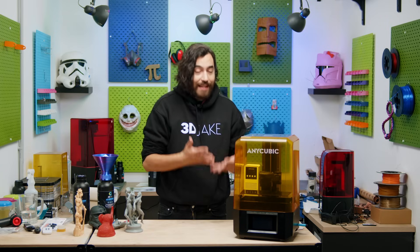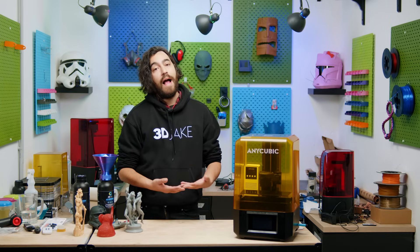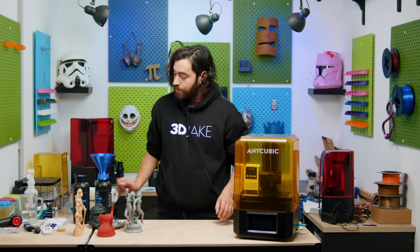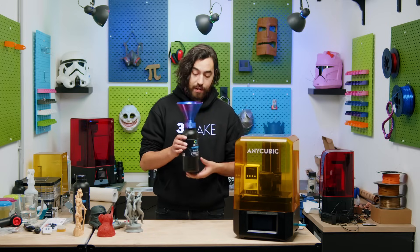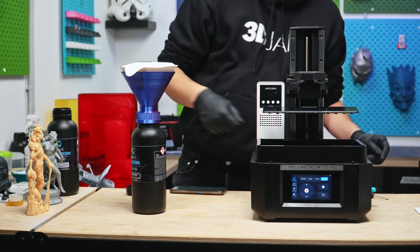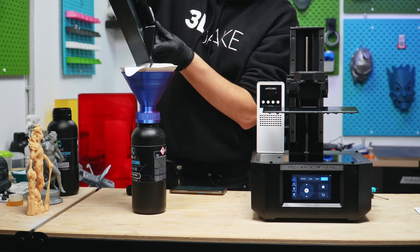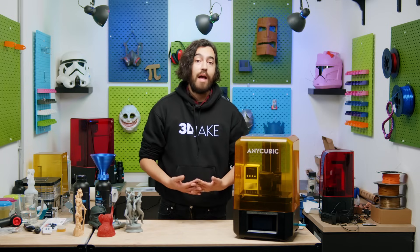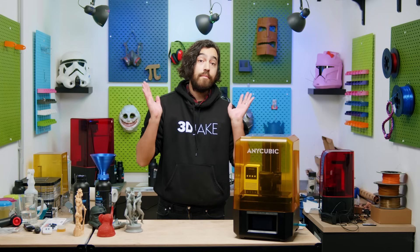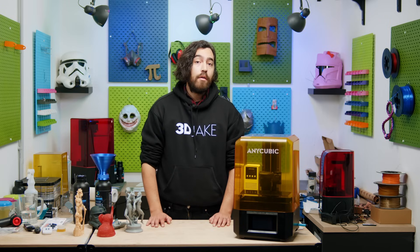But what other reasons do I have for liking this printer? The cleanup. Nobody likes cleaning up after a resin print. You're finished your print, there's still some resin in the tank, you take it out and pour it back into the funnel that goes into the bottle, but there is still always a little bit of resin in the tank that is impossible to remove. By the way, you can print funnels that will screw onto your resin bottles — there is a link in the description below. This makes putting resin back into a bottle a lot more easy and fumble-free. Resin is viscous — even the really watery high-speed resin is quite viscous. It sticks together, it has high surface tension. It's pretty much impossible to get all the resin out of your tank simply by pouring. So what we do is we get some IPA or some resin cleaner and rinse it out, maybe use a paper towel, before topping it up with a different color resin. It is a bit wasteful.